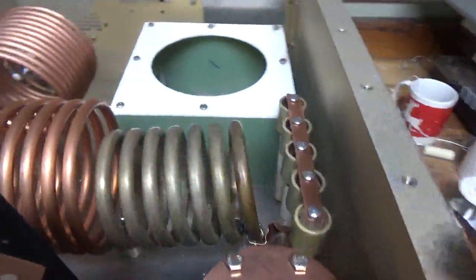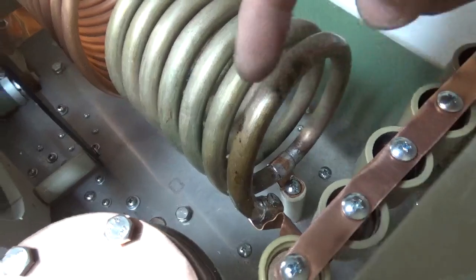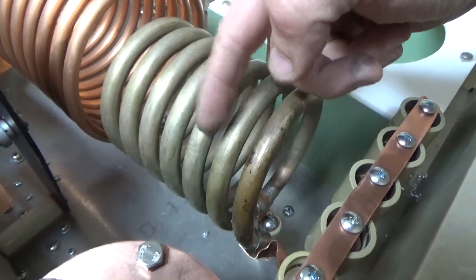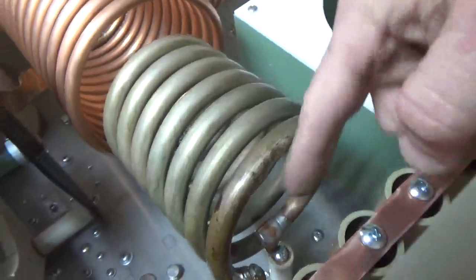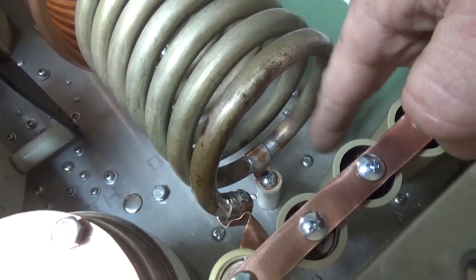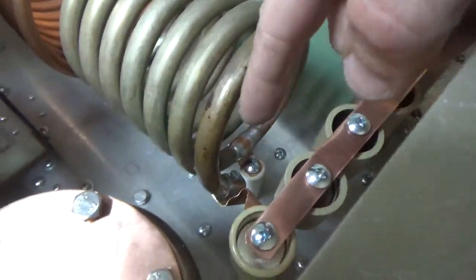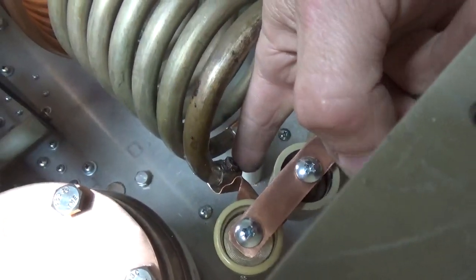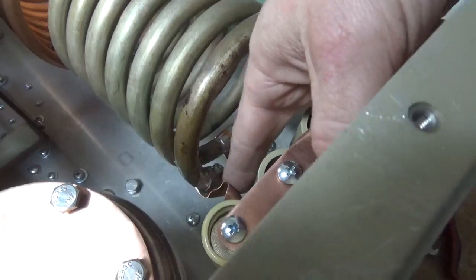I'm going to show you what it looks like. I put a strap around the coil and connected the coil to the standoff. This is part of the main coil, and a little bit of this will also be the pre-inductor — I'll go over all that in the next video. I secured it to a 2-inch tall, 3/4-inch wide standoff to the floor, so now it's rigid. I clamped a copper strap that's 3/4-inch wide around the end of the coil, crimped it, soldered it really well, and put a 6-32 screw through it with a keps nut — so that's not going anywhere.